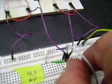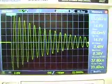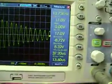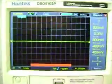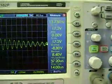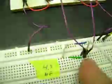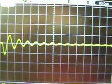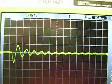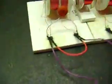Alright, now we're going to flip over to the bifilar coil and start flicking. It's a much healthier looking waveform. What are we at? It says 16.9. We're actually off the scale, so we need to jump up. 17.2 peak to peak. And now we'll flip back to this, since we changed the scale, and see the difference. This regular coil with the capacitor is dying out pretty quickly. This capacitor is a 500 volt capacitor. We haven't even approached that, so it's not the capacitor failing.